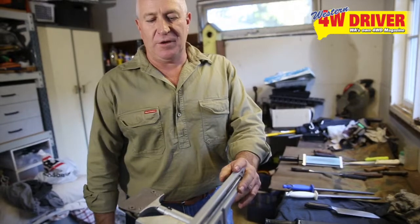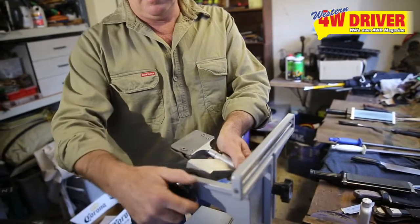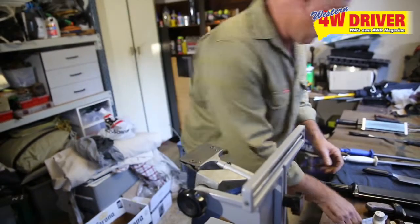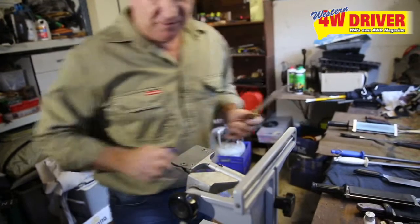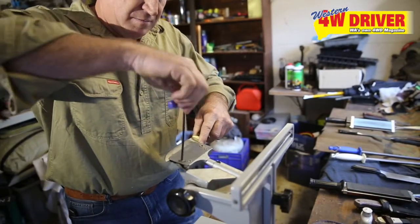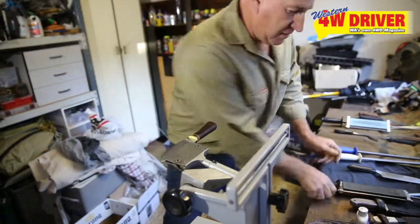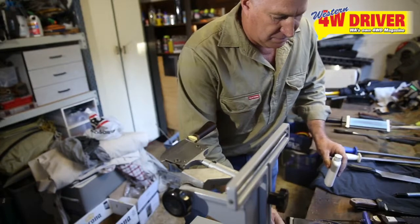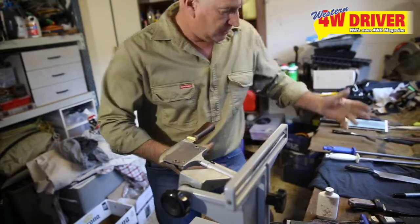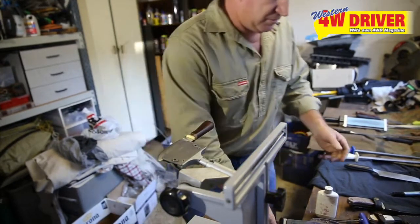For a resetting tool like this, a system like this one here, where you've got the adjustment on both the edge here once your blade goes in. Actually, should we put a blade in there so that you can see? You just have to nip it in, and then I can do the flip over part. Have that stone nice and close, have the oil sitting there as well. We've got everything we need on there.